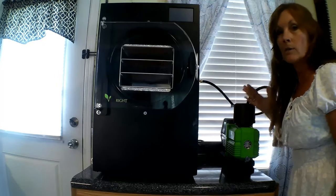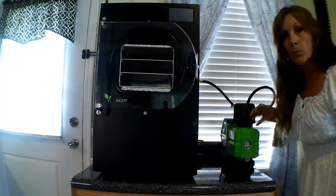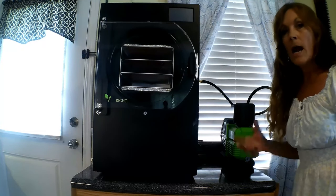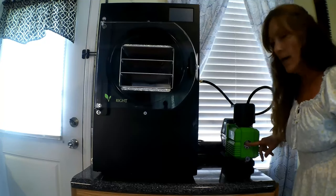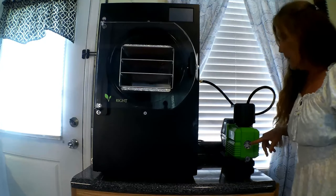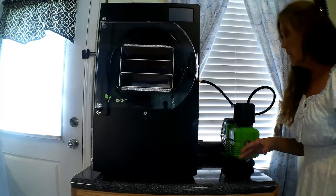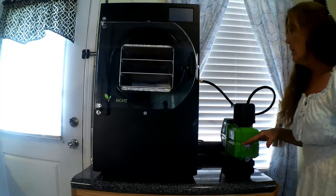It doesn't take very long to change the oil. This is where you put the oil in — this screws off, there's a little hole and you pour your oil in there. It has an oil level indicator that shows minimum and maximum — you want to fill it to the middle. I noticed that after filling it and waiting 24 hours, the oil rose a little bit. If you overfill it, just tilt it over and the oil will come out, then pour it back into your container. Let it settle so the oil reaches the midline.